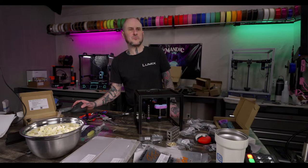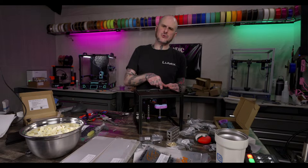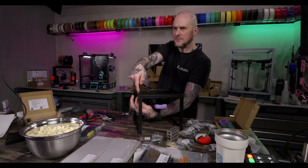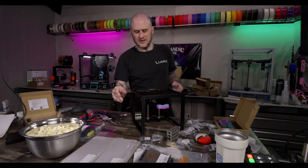Do a maintenance stream. I will. Have some rails with fill points. Fill ports. It's not as good as a full relube. I was looking at that. There's a mod to add fill ports to regular extrusions. You use a hollow M3 nut or screw, titanium screw, and you drill through an extrusion, on the top side, the opposite side of the linear rail. You drill through one of the holes of the linear rail, install a screw that goes through the top of the extrusion so you can grease through it. It's a neat idea. I doubt I'll do it, but...